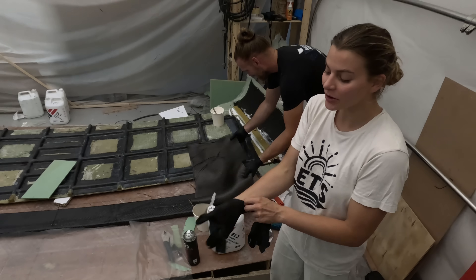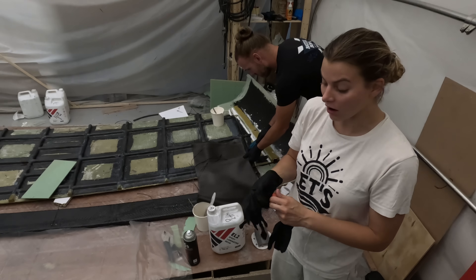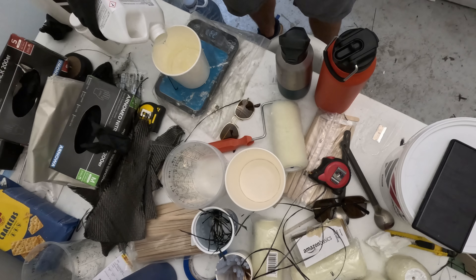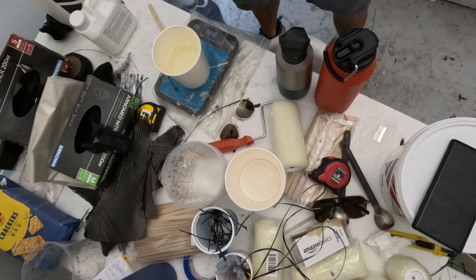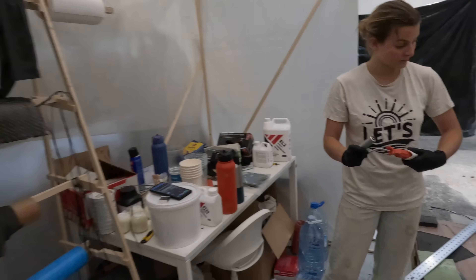It's gotten warmer, so I'm doubling up on gloves. It's always good to do because then you can tape the top layer of glove off and have a clean glove. But we've gotten to the point where the inner glove needs to never come off because it's sweaty. We're running low on paintbrushes - I need to order more. We've learned that you can't really wash them and use them the next day; you can wash them and use them more that day, but that's it. That was fast cure epoxy. The curve is all done - it's all glassed on. It overhangs a bunch here and it's too long - this is the line it needs to go to. It'll all get cut to size, but it's easier to make it a little too big and then cut it to the exact size since we don't have that perfect of a form.